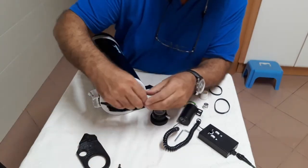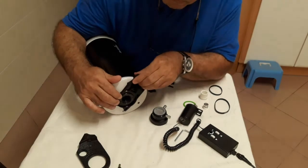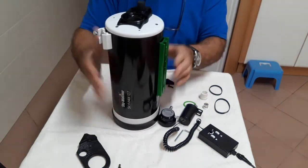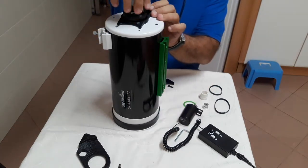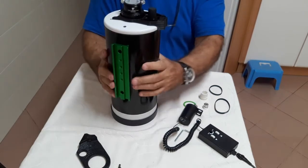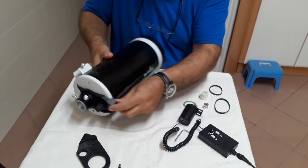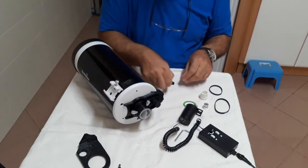Let's start the assembly of the 90 degrees adapter. It fits tightly in the visual back thread and some sanding may be needed. The ring is reinforced to avoid bending and has room for most of the SCT to 2-inch eyepiece receptacles. The adapter is much more rigid than in previous versions, since on some telescopes the dent or step between the tube and the back end does not exist at all.